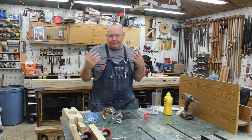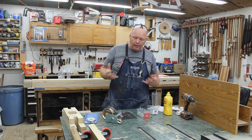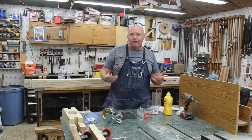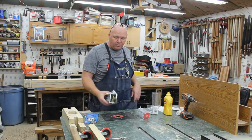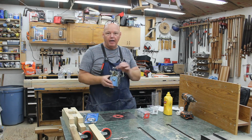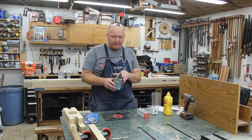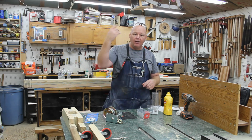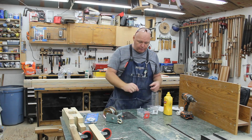To build this lift, it's pretty straightforward. You're just going to need some hardware. These lifts, if you buy them commercially, are $500 or up. First thing you're going to need is a winch. This one I bought through Amazon. It was only like $20. The one plus you want to get with any winch, if you can, is forward and reverse. That way you've got controlled cranking going up and down. But you choose what you want.